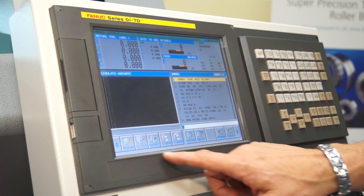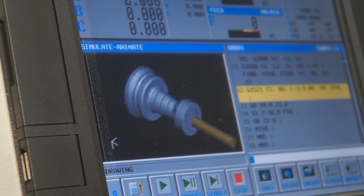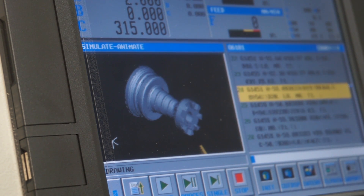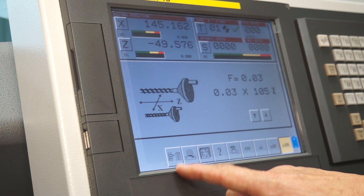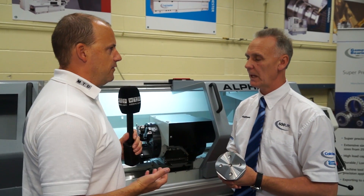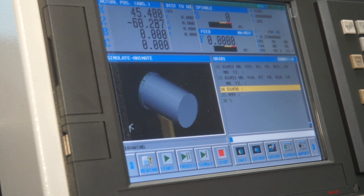Control — so if you're looking to program something like this, you can do that. I know you've got the popular FANUC control and you have your own control system, the Alpha system as well. Would you program this in FANUC and the manual guide? We have, as everybody knows with the Alphas, three programming systems: our own Harrison's Alpha system which is unique to us, then the FANUC manual guide conversational programming system, and the full CNC G-code system. The turret and C-axis work will never be fitted onto the Harrison's own Alpha — all the C-axis will be programmed through the manual guide, conversational programming, or the G-code programming system. The Alpha system is a very entry-level type of control system, so when you start to get a little bit more sophisticated, manual guide and FANUC is perfectly placed to assist that.